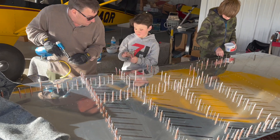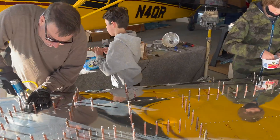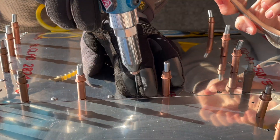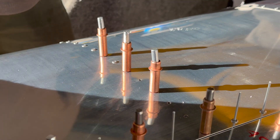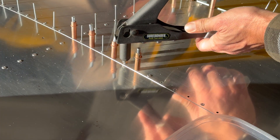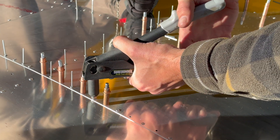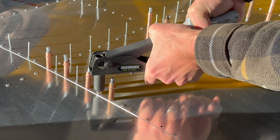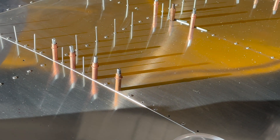Alright, here we go — middle span on the left wing, button her up. Put that down there, hold it down. You see what I'm doing with my hands? Give it one big squeeze. Make sure you're pressing down on the rivet. Open it up, seat it again, feel where it bites, squeeze again.